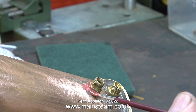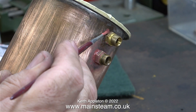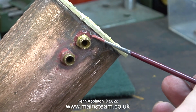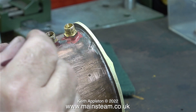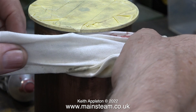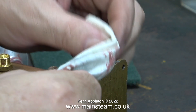Some people wouldn't bother doing this and would just live with the gap, but on these large hexagon fittings it makes things a lot neater. I should mention I missed out one earlier operation: before applying the putty, I ran some thin cyanoacrylate adhesive into the gap between the hexagon and the tank, wiped away the excess, and let it dry. The cyanoacrylate adhesive acts as a great key for the next layer — in this case the cellulose putty. After painting around all the fittings I wiped the surplus away and everything looked quite good.